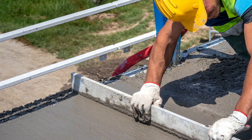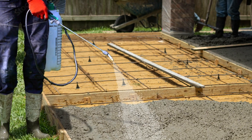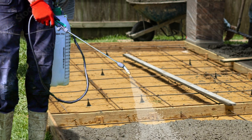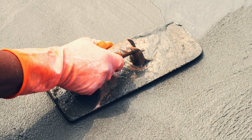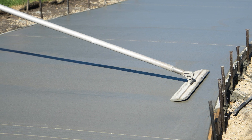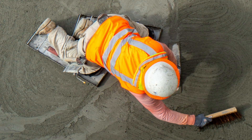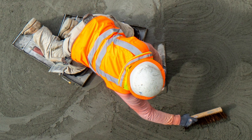After placing the concrete, you would first strike it. Next, you would spray an even coat of Control Finish on the surface. And then finally, you would trowel or float the surface to work the Control Finish into the top layer. This provides additional control of the set time on just the surface layer, which helps with crazed cracking and crusting caused by excess heat or wind.